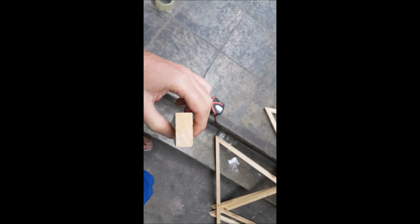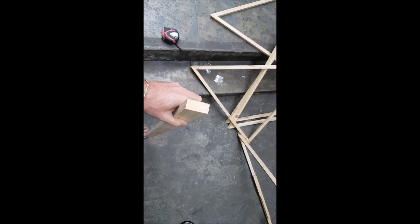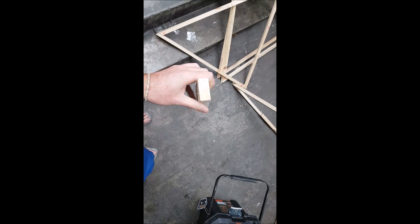This is the wood we started out with — it's 2 centimeters by 4 centimeters. We cut them in half at a 73–74 degree angle to end up with two beveled struts. The struts are pretty weak for the size dome we wanted to make, so if you're building a 2.5 meter diameter dome or anything bigger, you probably want to use something twice as big, or at least 50% bigger.